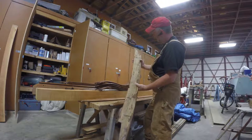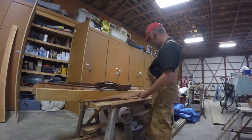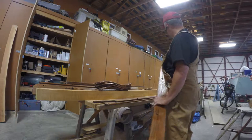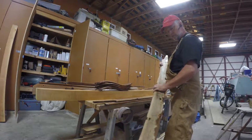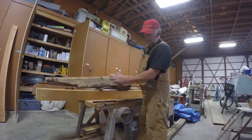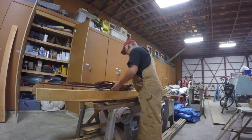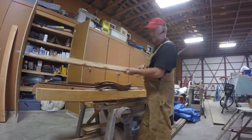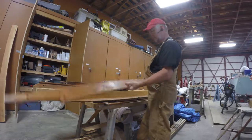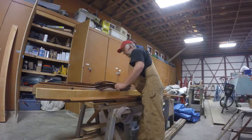The epoxy seems to have soaked into the wood and sealed everything. It looks not bad. I didn't put it on there to make it look good — I put it on there to seal the wood. I'll probably do the back side too, because water will get underneath the cap rails and stay wet. So rather than have it just sitting there getting wet, I will seal it and prevent that. That's probably a job for another day, though — it takes quite a while to paint all these up.